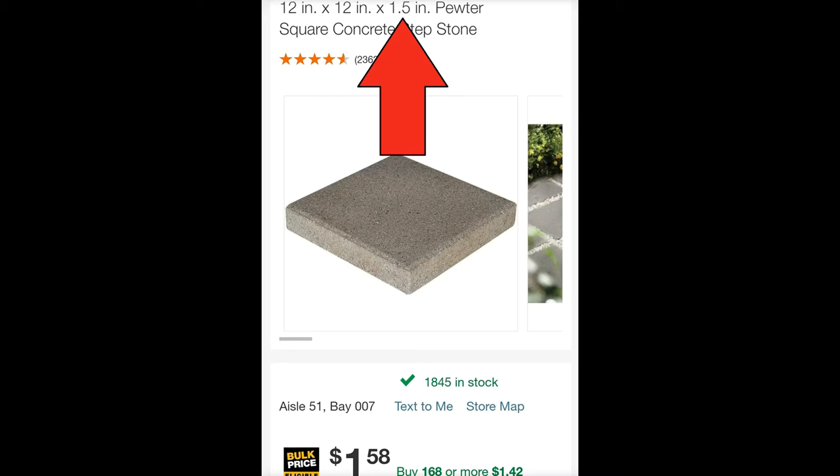If you get stuck buying these thinner ones, you'll just have to be more delicate with them. When you're buying your pavers, you want to be aware that some of them are beveled on the corners. This is actually a nice feature, unless you're buying bricks to add to an existing system that doesn't have bevels — then it'll stick out like a sore thumb. If you made this mistake and bought the wrong ones, just turn the brick over. The bottom side's not beveled.